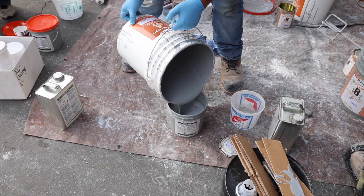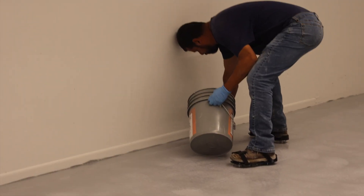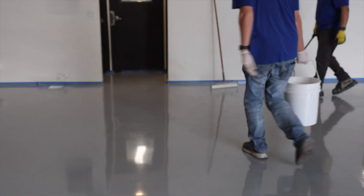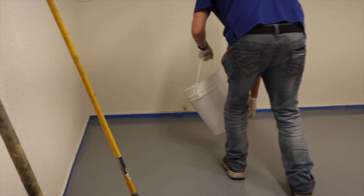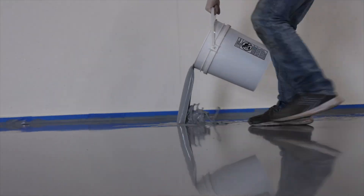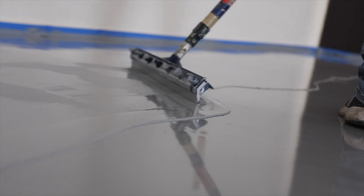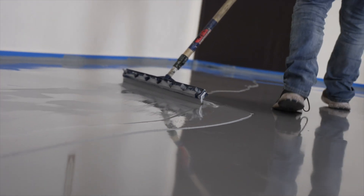Pour a small amount of the Poly material in a bucket and brush along perimeter stem walls and around obstructions. If you are not coating stem walls, tape around the perimeter and apply using a 6-inch mini non-shed nap roller. Start with the furthest corner from your exit and work your way out of the room. When possible, work left to right, pouring the material in lines across the concrete. Pull your squeegee through the material at an angle, allowing the wet polyurethane to flow down the blade onto the uncoated area.